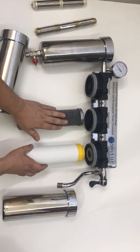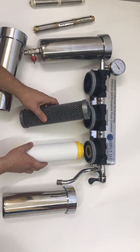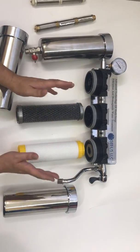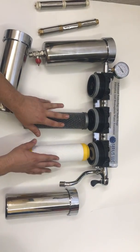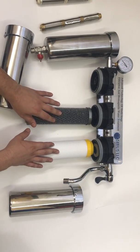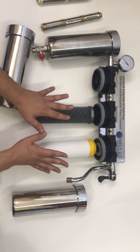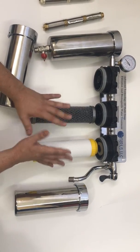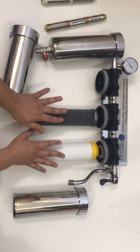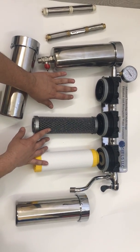You have extra steps for basically taking care of any kind of odor or smell that is left over after mechanical filtration. The best part is that the second and third stage cartridge filters — their shelf life becomes two to three times more, because they are not actually doing any dirt filtration or sediment filtration. They are just there to improve the quality of taste and odors, because everything else is done in the first stage already.